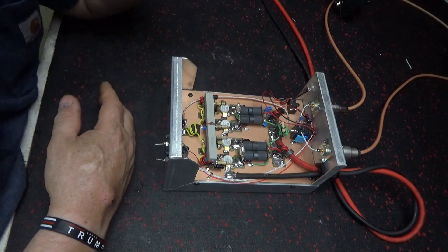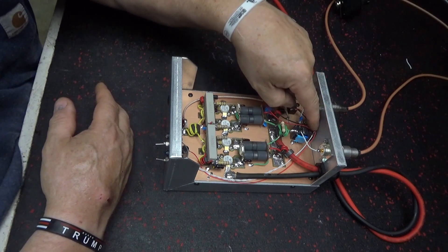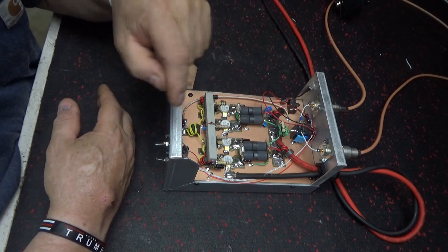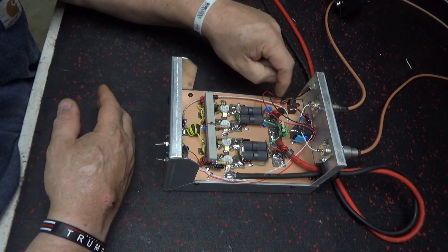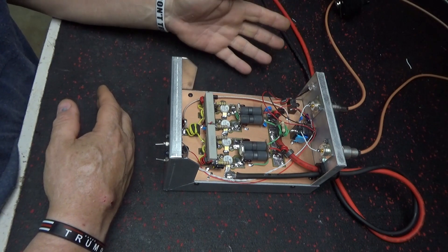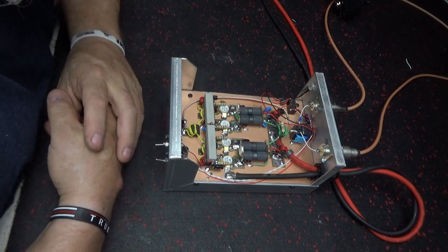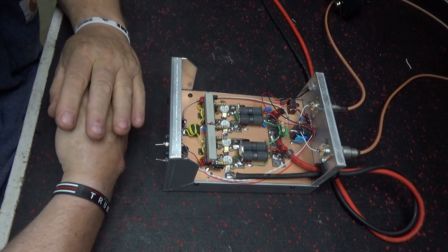This relay here is just hooked up like this one's hooked up. It's got a wire coming off here off the key-up circuit, so when the key-up circuit goes to ground, it sends it down that way to ground. It sees ground, this relay comes on, and it sends power from this leg to this leg and sends it up here to the antenna. So only when you key it this relay goes closed and sends the power from here to here, so those resistors aren't sitting out getting power the whole time.